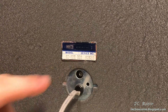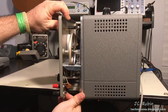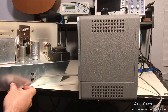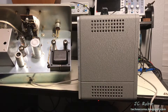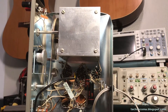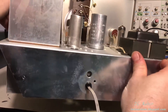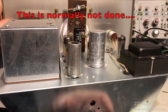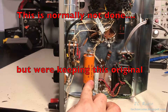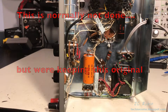Right off the bat we see that there is in fact a full complement of tubes, so that's a good thing. Not much by way of debris in the case — very clean. Everything in this unit appears to be all original. There is a single capacitor here rated to 150 volts that I'll be testing and reconditioning, and also a 20 microfarad dual down here that needs to be tested as well. Those are the three capacitors that require immediate consideration.